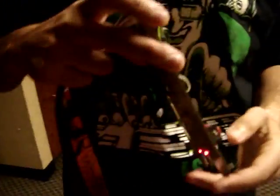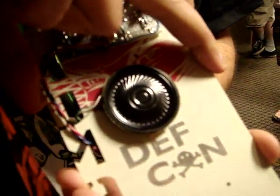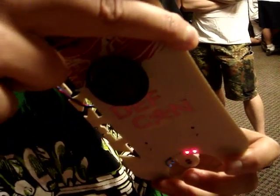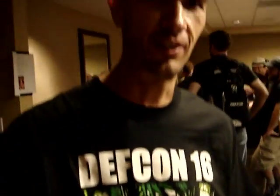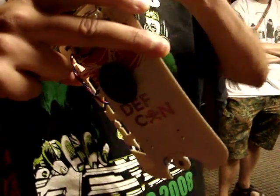I kind of grabbed another unused pin here in the corner. It still works. Can we hear any audio? Is this supposed to be like a 1.37 kilohertz tone? Not quite. There's some issues — I'm guessing, based on some debugging I did, there's something about modifying the duty cycle on the fly like this. There's probably something I'm not doing correctly — it's giving out kind of random crap. What I did is I set it up where I just put out a straight signal.